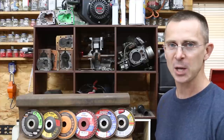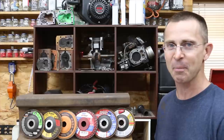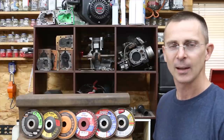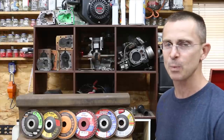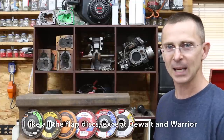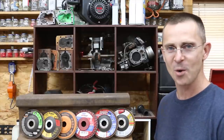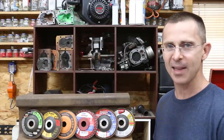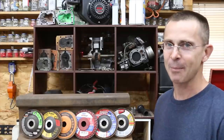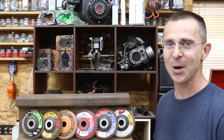It's hard to argue that the best value isn't the Makita because it did a terrific job removing rust and steel — removing the most out of all the brands — however it also experienced a lot of wear and tear. One could argue that the Diablo should take first place because it didn't remove quite as much material but the sandpaper is in a lot better condition. On the other hand, the Walter and the Norton should be considered top contenders because they too didn't experience very much wear and tear, and those two brands can be trimmed back extending the life of the wheel. I have a lot of DeWalt hand tools and I like the brand, but I definitely do not like their flap disc — to me it's costing twice what it's worth. Regarding the Warrior wheel, it just has a poor design; I would not buy that wheel — it's way overpriced even at $3.99. I have a lot of fun doing these showdown videos but I'm also open to other types of video ideas. If you have any, please leave a comment — I read every comment and reply to as many as possible. Thanks so much for watching!